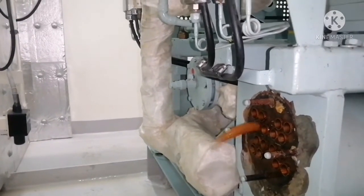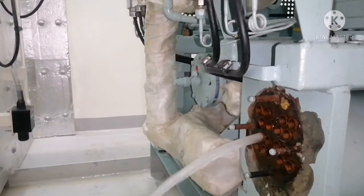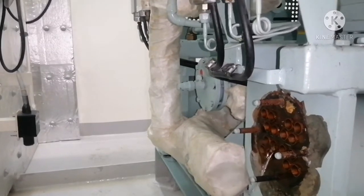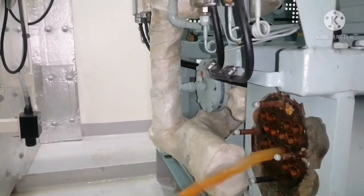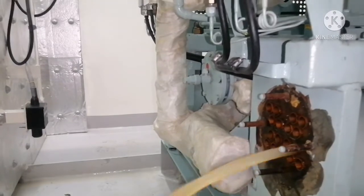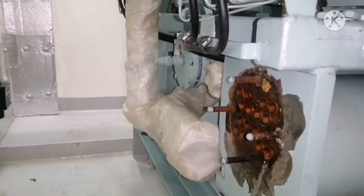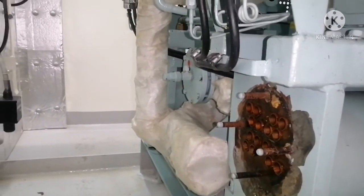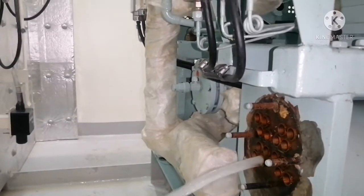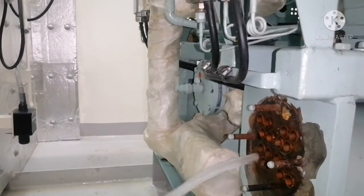Whenever you do the cleaning, please follow these methods. Before starting any cooler cleaning operation, isolate the lines. Ensure there is no pressure inside the cooler and no water flow — valves are holding everything. Once the drain is absolutely free from water, then you can open the side covers and start cleaning. It is a very easy method actually, nothing much complicated.